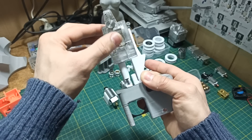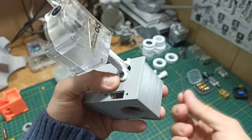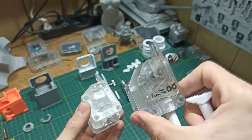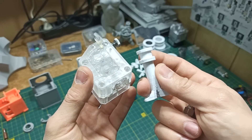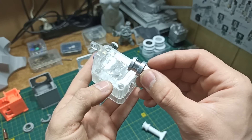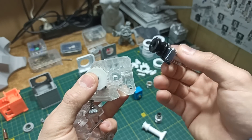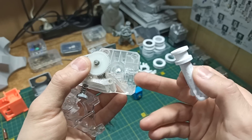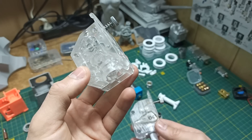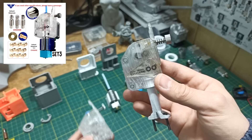The leg ensures high rigidity so the feeder doesn't move anywhere — neither up nor down. This cutout in our mount allows access to the fitting, press it and pull out the PTFE tube. I believe this modification will definitely improve print quality. The stock factory BMG, unlike Mellow Store, has an incompatible seating position, so I developed a separate leg for it. The problem is that the fitting holder was designed in reverse — the thin part should face outward, the thick part inward. Therefore if you try to install E3DV6 directly into this BMG, it simply doesn't fit. The same goes for ENF and two other hotends I tested. Moreover, even a viewer of my channel noticed this flaw. But this leg fits perfectly, because it was designed specifically for this stock BMG. But honestly, too many flaws for one device — better to pay a bit more and buy a complete set with E3DV6 and a quality BMG.